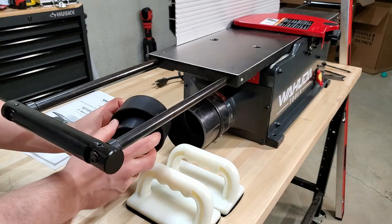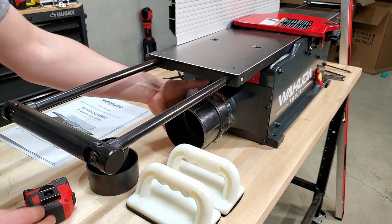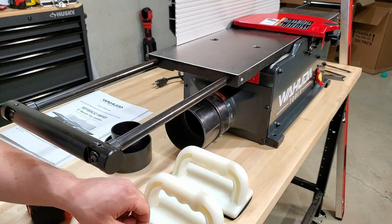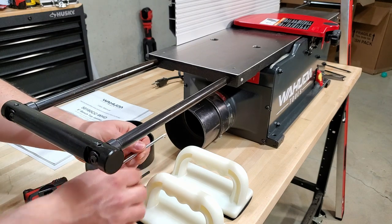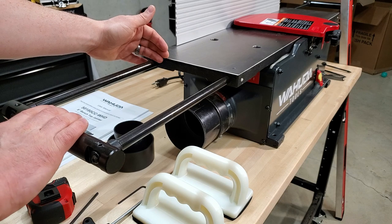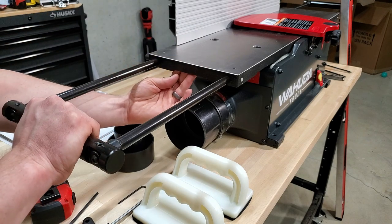It comes with an accessory to neck down to 2½ inches. I've got a Rockler DustRite attached, so that portion doesn't come with it, but it has the 4-inch standard dust port. It comes with two push blocks — I've got my own that are a little bigger and nicer. It comes with the necessary Allen keys to adjust everything, as well as a Torx key to index the cutter heads. You've also got the extension wings, which pop out another 11 inches off the end of the table. The tables are 14½ inches long each, and the total bed is 30½ inches.